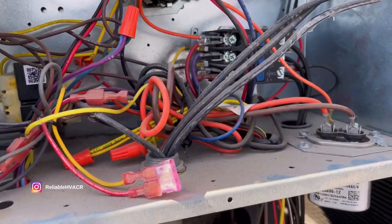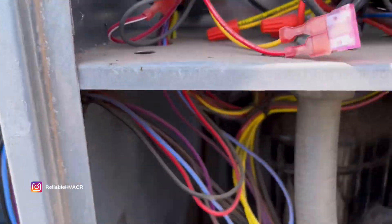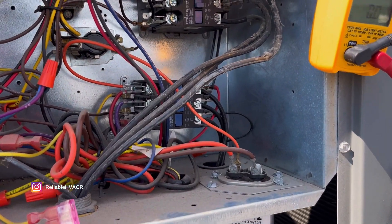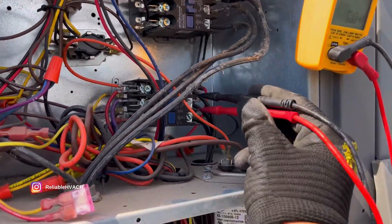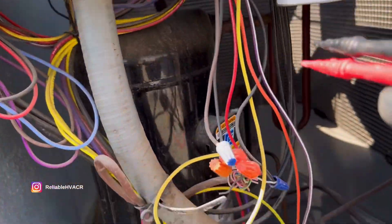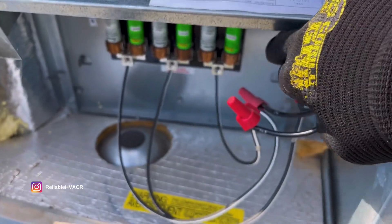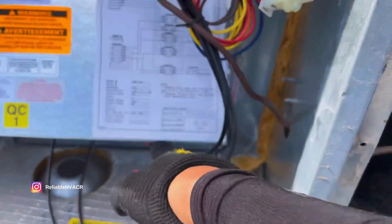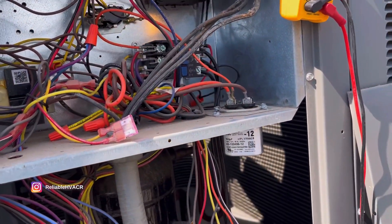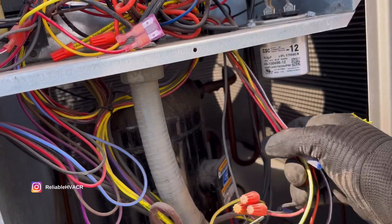I do have three-phase there for the blower. Down here though, I'm missing power. If you follow the line, it goes here — these are my lines, there's a fuse box down here, so more than likely we got a blown fuse. I'm going to double check the windings right now. I already checked for shorts and didn't see anything there — nothing obvious. I'll look at my wiring and we'll see what happened here.